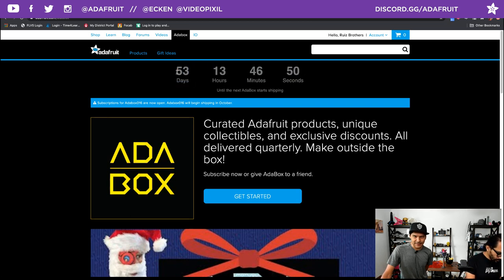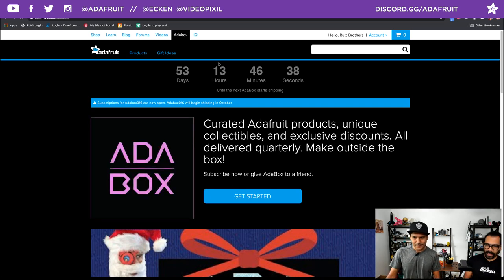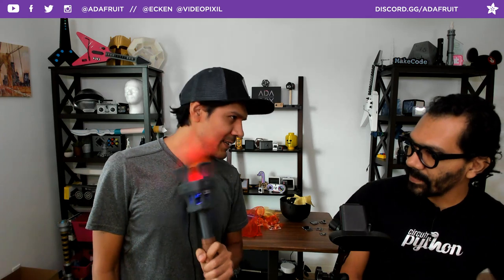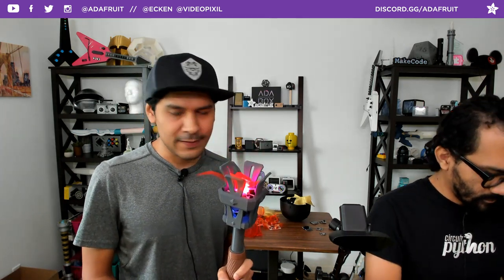Let's go ahead and jump into this week's awesome prop-inspired project for the upcoming Halloween season — kicking it off with this cool LED flaming torch. Huge shout out to Nick Daimlo. He does some awesome designs and he released a medieval torch with a Gemma M0 and a NeoPixel ring. It uses a bigger fan, so I figured I'd like to remix that for the smaller fan. We have this little 5-volt DC fan that we've been using in various projects, actually the Fume Extractor project. Let's make it smaller and fit the NeoPixel jewel in the front.